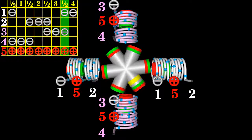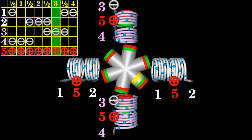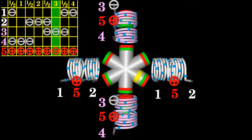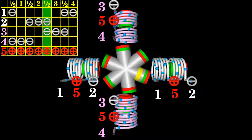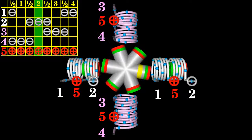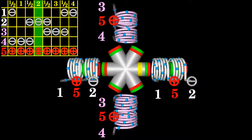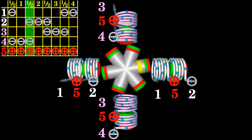This motor can also be commanded in half step mode. Even in this mode, no more than 50% of the windings are energized at the same time. Unipolar stepper motors only utilize half of the coil length, so less torque is available to magnetically move or hold the rotor in place. To get nearly the same torque as with the bipolar type, twice the number of windings is needed, which is why unipolar stepper motors are usually larger.